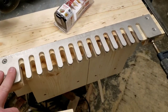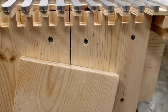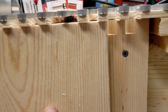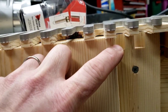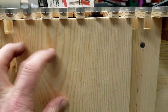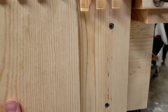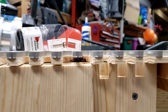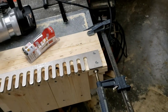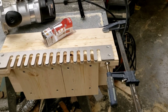It clamps onto the table saw, it's got my metal jig on top. What you do is you take a box board, slide it up against the bottom of the jig — the first piece lines up flush with the edge of the first finger — and then you run your router in between each of the fingers. On your next piece, you start at the left-hand edge of the next finger, then you router your pieces out and you get a nice strong fit.